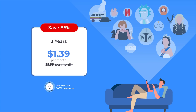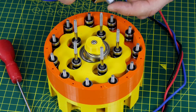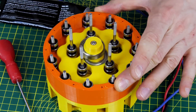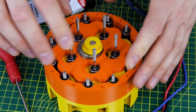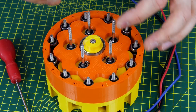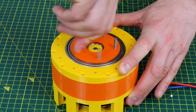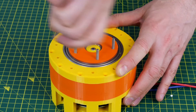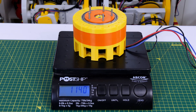I thought I should open it up again and put some silicone grease in before we do too much testing. Although most of the friction is between the cycloidal discs and the bearings, the cycloidal discs are also resting on each other and on the top and bottom housing. Everything's still 3D printed in PLA which has a pretty low melting point — we don't want it all to melt with any friction. That seems to run pretty free. In terms of mass, it's a bit over 1.1 kilograms; the previous version was 850 grams, both including the motor which weighs about 450 grams.